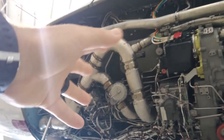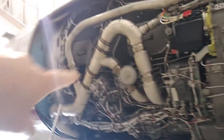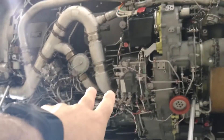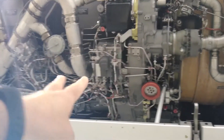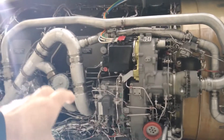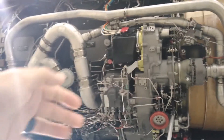Some extra fuel heats it up through combustion and it's exhausted out the back. Now these here, these two ducts, are special ducts called bleed air ducts. They bleed air from the compressor — two different stages of the compressor — and duct the air away into the aircraft for different functions.